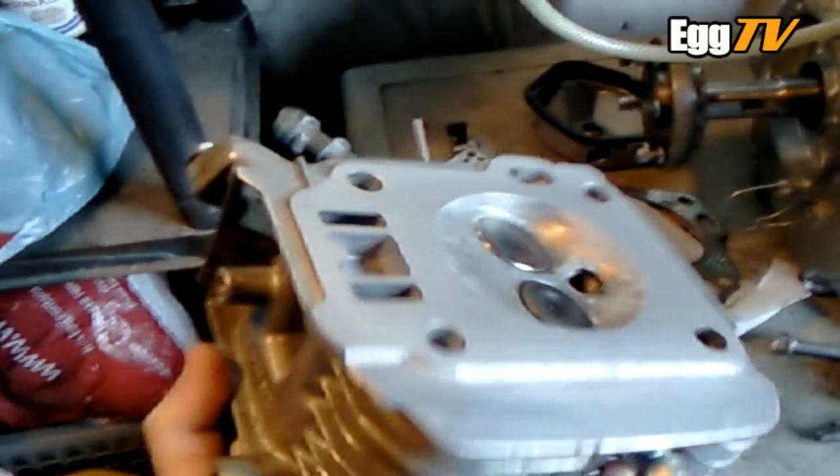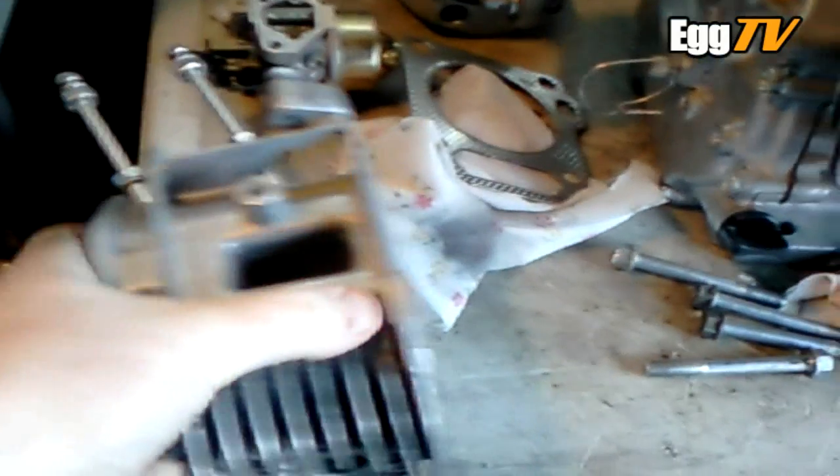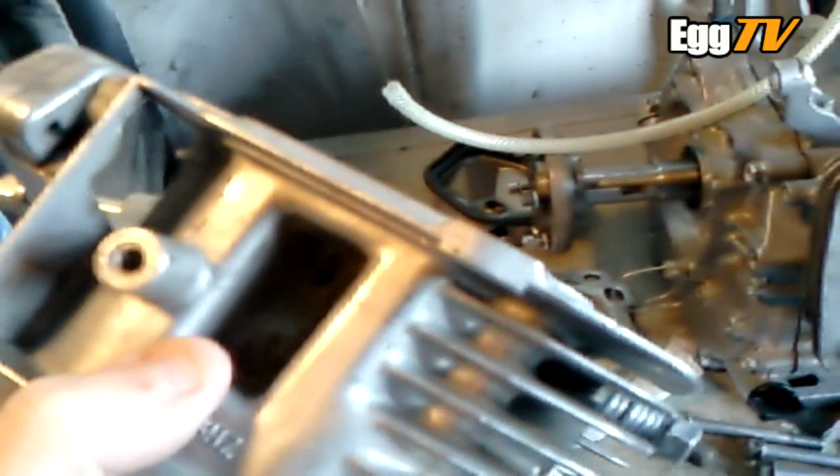I've done both sides. I've had some really smooth MDF and the spirit level on, using it for the elbow grease routine of milling the head down. You can just see that one mill mark glinting right on the edge there - that's one mill mark I made when I first took the head off months ago. I milled it a little bit prior to the first rebuild and probably took about half a mill off.